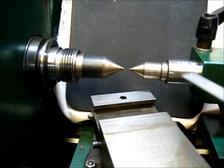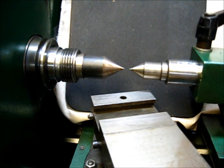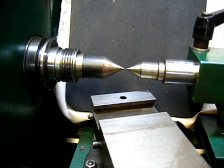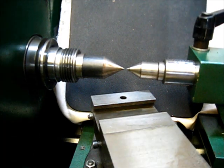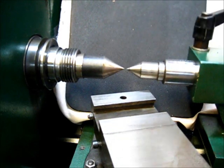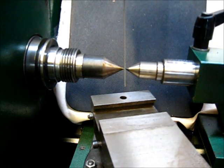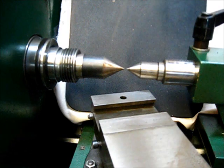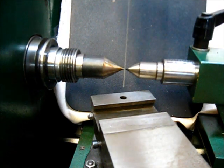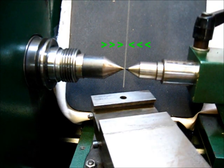I'm going to run the quill out about one inch and just snug up on that lock — not tight, just a good snug — and run it up to about an eighth of an inch, then lock the tailstock to the lathe. You take your six-inch ruler, put it right in there, and bring the tailstock up to the dead center, bringing those two together with enough force to capture your six-inch ruler.